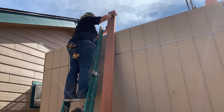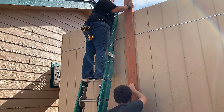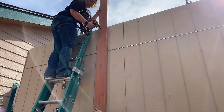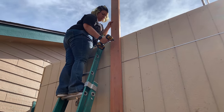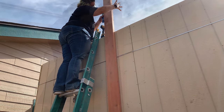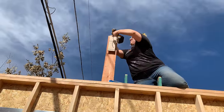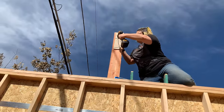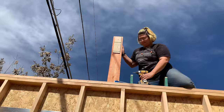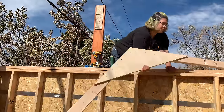We're going to pick up right where we left off last time and begin by installing the roof trusses. Taking a scrap board like this 2x6 and mounting it to the side of the shed with some screws will allow us to attach it to the first roof truss so that it doesn't tend to wobble or fall over. We want to make sure it's level, going right up to the middle of the truss. Since we have siding on the outside of the building, I need to put a little piece of siding on the front of this support to space the truss back by the appropriate thickness.